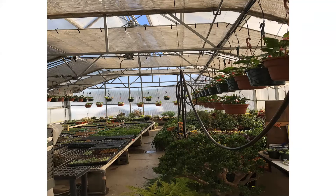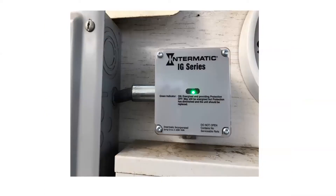On a warm day the energy curtain is about halfway open, helping moderate the temperature a little bit. In our 40×100 display greenhouse this also keeps customers more comfortable on a hot day. We use a whitish Lexan on that roof rather than clear — it's more of a maintaining house than a growing house. On energy curtain cost: for a 40×100 or 30-foot gutter-connect, it's going to cost roughly $10,000 plus probably $5,000–6,000 for installation, depending on whether you're doing a new build or a retrofit. The payback is incredible and it's well worth it.